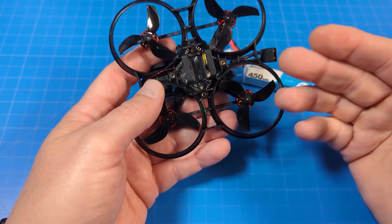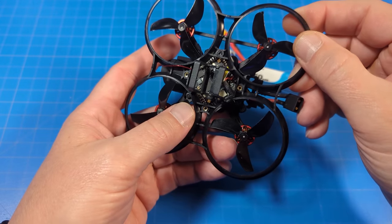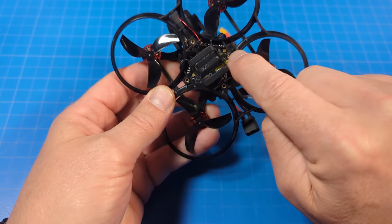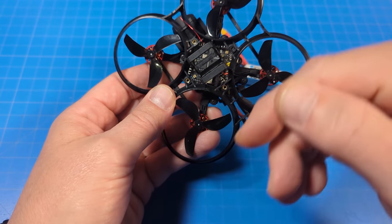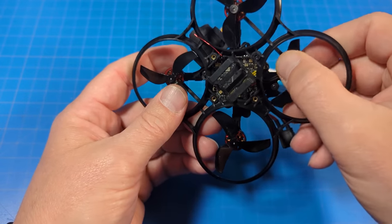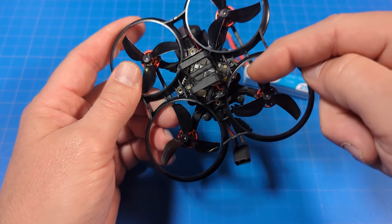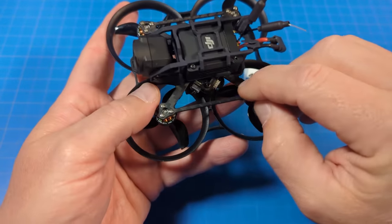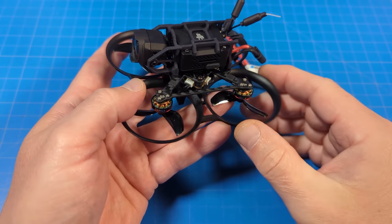The board in here — I don't know if they'll sell it like this, so I don't know if it's worth talking too much about it. Of course if you build it you use your board of choice. One callout: in my particular frame it looks like we have brass pressure fittings in the whoop protection, but this one over here is either a black fitting or not brass — I hope they would all be the same come production. I did apply tape to the arms to make sure the motor wires stayed up there, because there was enough slack that if you go tumbling and those wires come down, I don't want them getting chopped. It's not ideal because it is close to the actual motors as the wires come out, but it does help keep those wires up just a touch.